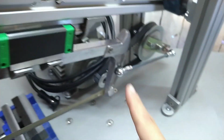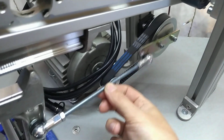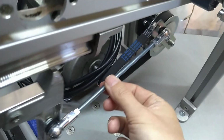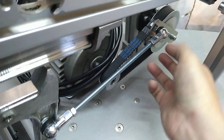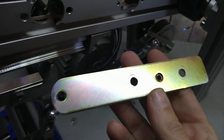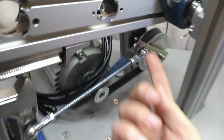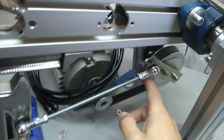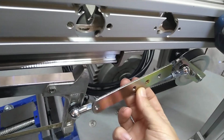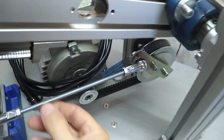And the next thing is the mechanical connection to the saw, and I use these, I don't even know how they're called, anyway, you see what I'm talking about. I use these to make the movable connection. Some use a flat piece of steel like I have here, which is actually from an L angle. This is the first one I did, which was too long, so I made the second one shorter because it did hit on the bottom of the profile here. Other people use these and then put bearings in here, and I wanted to do it simpler and it worked.